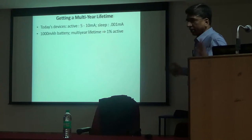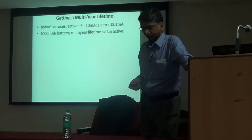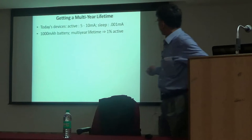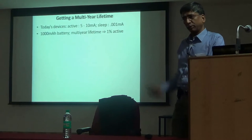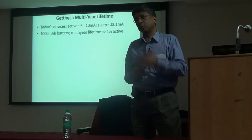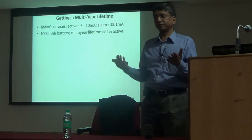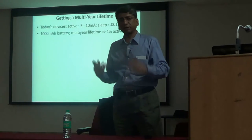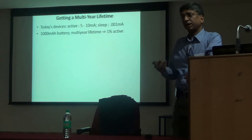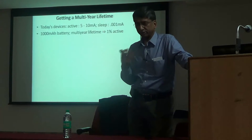So if you have a 1000 milliampere hour battery, your lifetime is just about 4 days. So what do you do? You keep this mostly off. Suppose you keep it off most of the time, only 1% active, then you get 100 times the lifetime, so it becomes 400 days rather than 4 days. So the way you do that is to keep it mostly off. So again, this is the impact of the resource challenge nature.